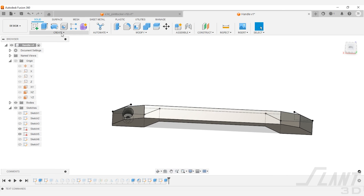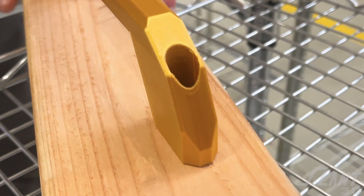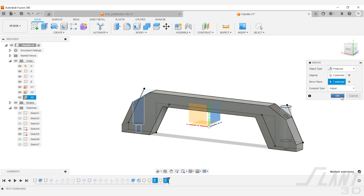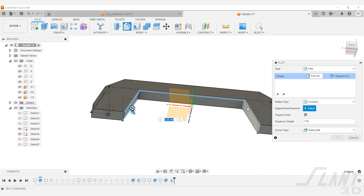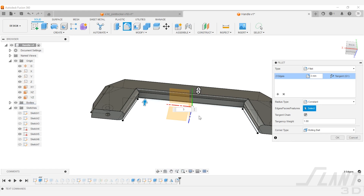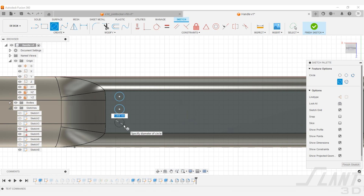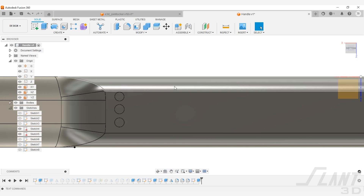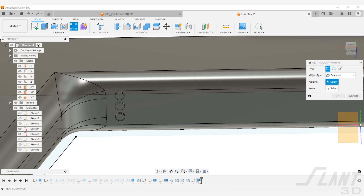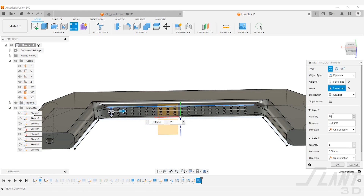Now you can just have a countersunk hole that allows the screw head to enter into it. You have a lot of supported material around it that's very deep, and a very uniform looking part that no longer has cutouts. Since we like chamfers all the way around, we're going to apply them everywhere with just a little bit of rounding on the inside to make sure those edges are soft. And 3D printing allows us to apply textures for basically no cost, so we'll put a small grip texture along the inside for extra friction.